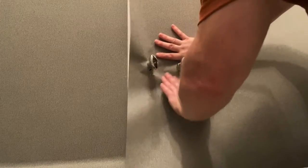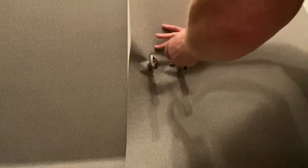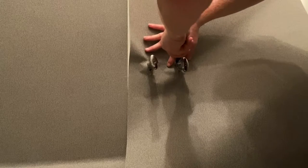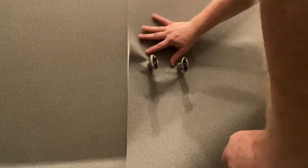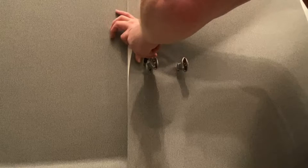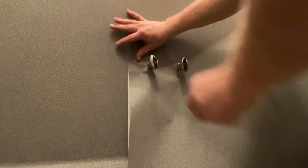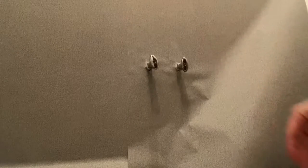Now we guide it back — two hands. We don't want to tear it. Now we're going to start making stress relief point cuts, so that instead of continuing to tear the original cut, it'll start laying against that pipe. We want to go on the side of the pipe and press against it, lifting the paper so as not to nick the PVC pipe. Now we can say this is a professional job because we've taken the time to cut that wall covering as little as possible.